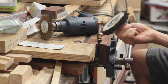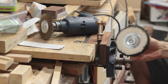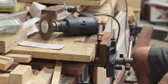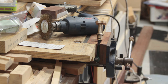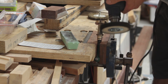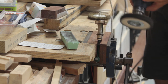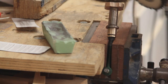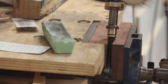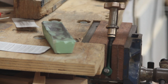At this stage I'm ready to move back onto the sisal. I'll start with the green compound and see what happens. I probably should use the faster cutting compound to move on from the wire brush marks, but I'm curious to see how these scratches turn out. The surface has started to blacken up a little bit from the compound, which means there's a bit of swarf coming off and leaving residue behind — I'll have to clean that up once I'm finished.